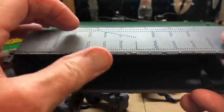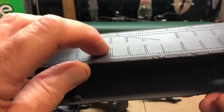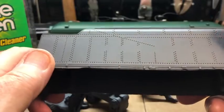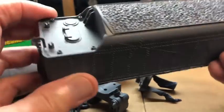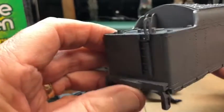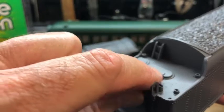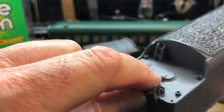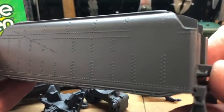All the stroking is done the same way for different angles on surfaces that have relief. I know these are small, but still they've got four sides — actually five sides, technically. Even though they're round, they kind of have four different directions you can paint them. Using this technique, keeping the right distance and smooth spray strokes, allows you to fill all those cracks and crevices but not overfill. Look at the relief around that access point right there for the water reservoir — it gets it in really good and sharp, and that's what I'm expecting the final coat to do.